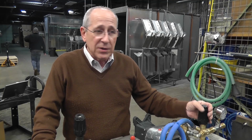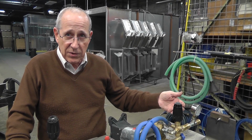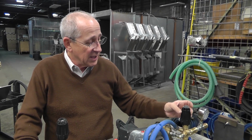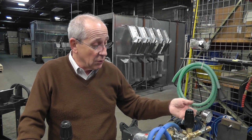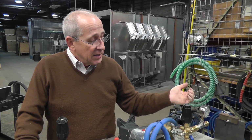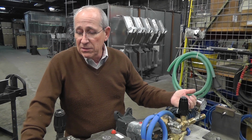We were talking about adjusting the unloader and increasing the spring tension to have your pressure go higher or force more water out the nozzle. There are limitations on that, as I mentioned, about creating a high pressure spike by running out of the nozzle to where no more pressure is climbing, but you keep putting spring tension on. The spike that I talked about coming back can be extremely detrimental.